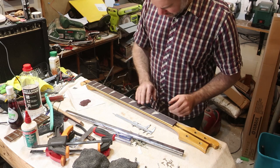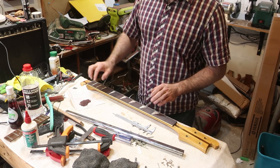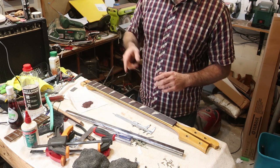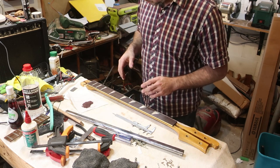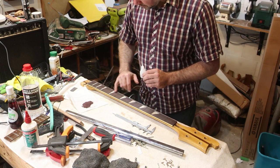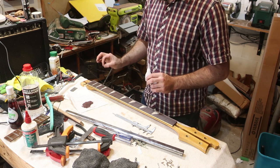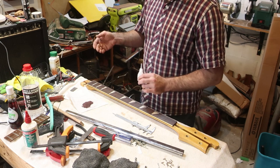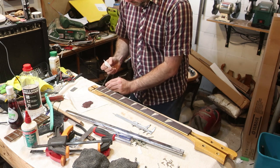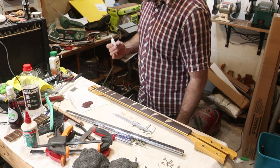It is looking good and smelling lovely. Rosewood is great. I have sanded out to 120 and I've saved some of the sanding dust for filling the slots — I'm hoping that's going to be enough. If it's not, I do have another vintage Japanese neck over there which is never going to be an instrument again, so I can grind some up. The only thing I need to test now is some super glue on the inlays, because I believe these are actually just plastic. I'll just drop a bit on there and come back in 20 minutes to see if it sticks. Basically, if I tap it with the edge of a chisel and it peels off cleanly, then we've got a problem — can't use it. Just a little drop just to see. And it's gone everywhere, of course it has. That's alright — we're not done sanding. This is just a little test and we'll see how that goes.